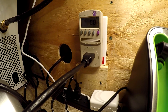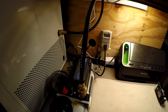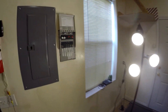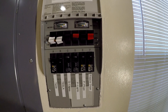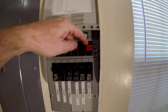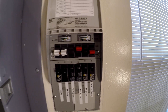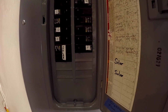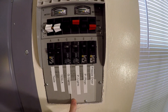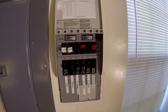Note that I'm only going to plug the freeze dryer into the kilowatt meter, so we're getting just the freeze dryer. All this other stuff — lights, fans, whatever else — will be independent. I just added this circuit on this transfer switch right here — the F circuit for freeze dryer — it's on a 20 amp breaker. This allows me to go from solar to the utility, and if I switch fast enough, the unit won't hiccup and drop out of the cycle. The transfer switch gets power from the utility and from solar, and I can switch it back and forth.